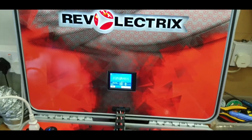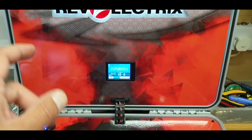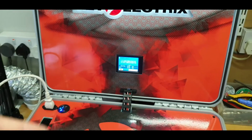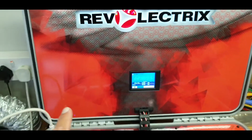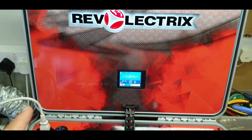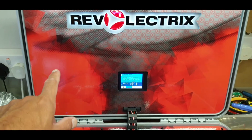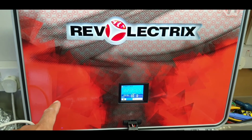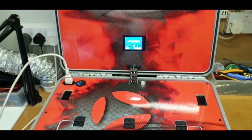I was then having to be a bit clever with the 3D printed parts to allow me to put a screw down through the middle to bolt the spacer into the lid, and then of course I would fit another one of my M5 brass inserts into the front of it to use an M5 bolt to secure the deck into the lid. Because this plate I used was a 10mm, I normally don't now, I normally go to a 5mm to save weight and cost. It allowed me then to drill the existing holes out that I had in there from, I think it was about 5.1mm diameter to 7mm diameter, and insert one of my usual M5 inserts, which I did.